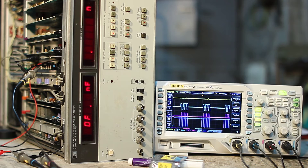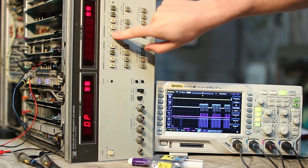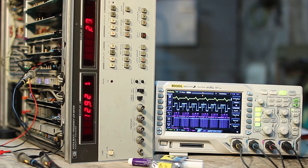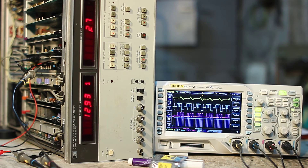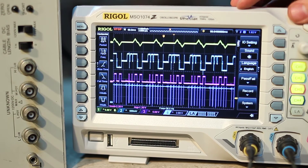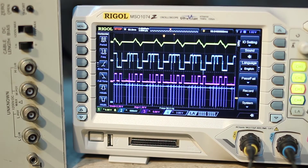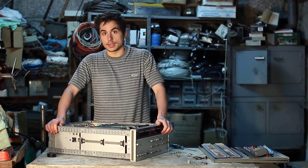This is looking good so far. Now the trigger lamp flashes, as expected. Let's repeat the same self-test, which was self-test number one. These are the same signals as before, but now the voltage in the integrating capacitor shows a much nicer triangular waveform. Time to put everything back again.